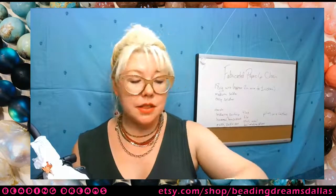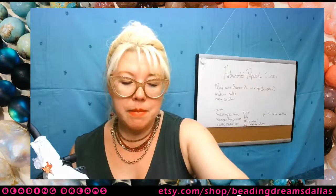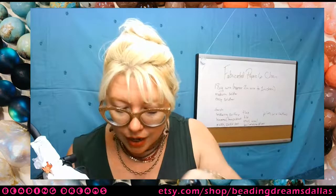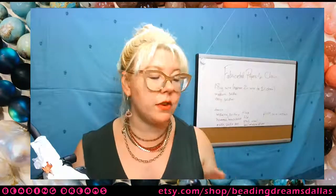This is not the best plan ever, as the great webcam melting incident of the latter part of 2020 proves. For anybody who remembers that stream, yes, I did, in fact, melt my webcam live on stream from reflected heat from my torch. So, you melted it dead, actually. I did completely melt it dead. So the moral of the story here is keep 6 to 8 inches, 7 is fine, of clear space around your soldering area at all times. The interesting thing also about things that are meltable is usually once they melt, then they're also flammable.